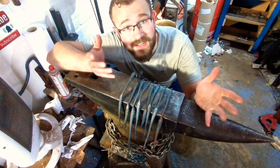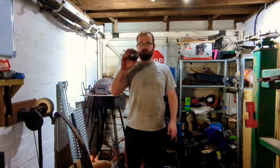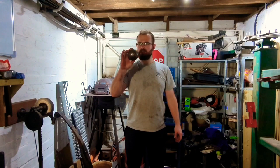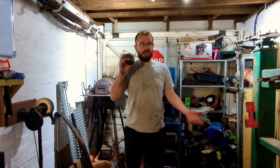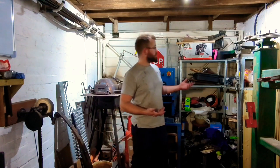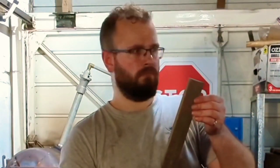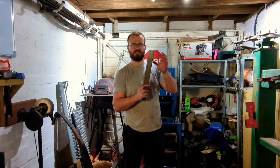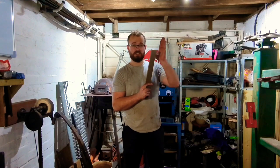With the legs all done, it's now time to move on to the body. I'm cheating a little bit because I've got one of these steel balls which I'm going to be using for its kind of butt, I suppose. What I need to do is forge down a piece of steel to make the actual torso — I don't know spider anatomical terms. I'm going to use a piece of square stock, chop a piece off the end, and forge it down into a sort of squashed oval shape. Then I'm going to weld all of this together, so first things first, I need to chop a piece off here.